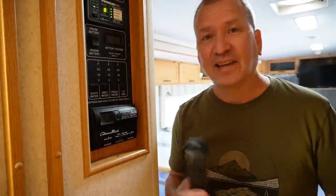All right, now the first thing that I want to do before I completely remove the heat pump is to test the airflow coming out of the ducts. Now, this is going to come into play later when I try to find and size up a blower that's going to be able to move air around. I know it's not going to be as strong because the blower in this thing is pretty huge. And trying to find a 12-volt system that has a big enough blower is going to be challenging.